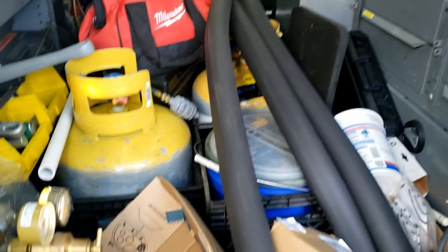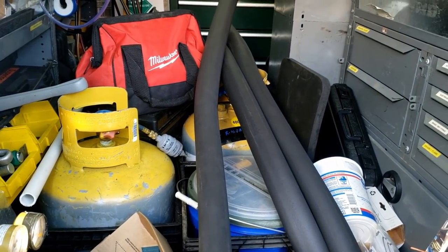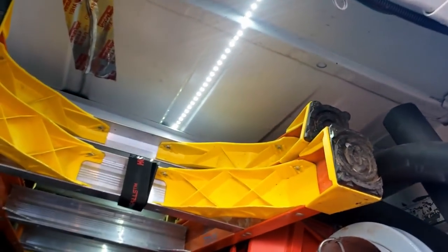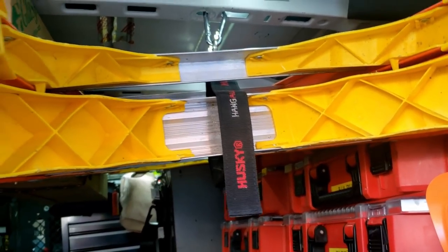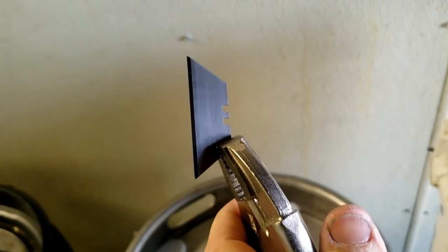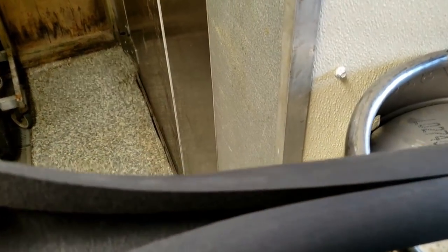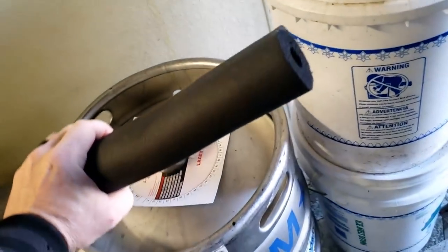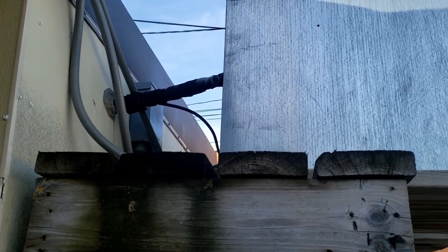The insulation we've got is three-quarter inch thickness by seven-eighths diameter — we're gonna get that on there. I need to dig the ladder out — it's my little five-footer, just strapping it to the ceiling and out she comes. I don't have one of those cool cutters so I just took a brand new razor blade, put it in my vise grips, and split the insulation right down the center. I like this type of insulation best other than that peel-and-stick garbage because it comes apart. We're gonna glue this with Armaflex glue and it won't come off unless they decide to tear it off.